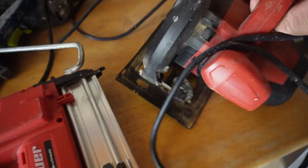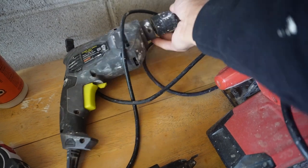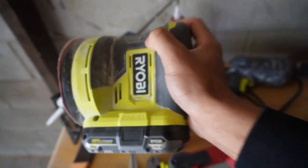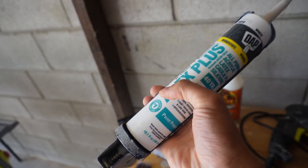You're going to need a circular saw to cut out the actual board after you draw your marquee out. You need a drill and a 3/4 bit to drill your holes for your lights. You need some type of sander to sand down your wood once you're done framing. You're going to need some caulk to hide all the visible lines once you're done framing your marquee before painting.